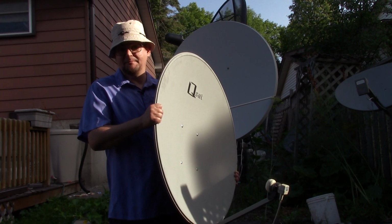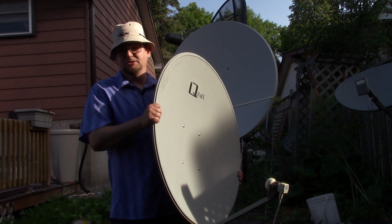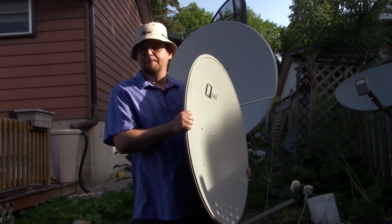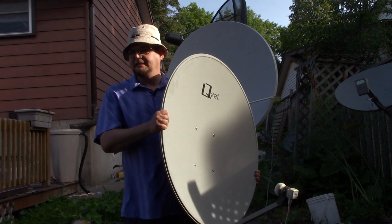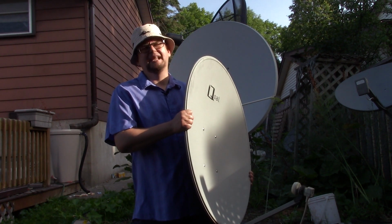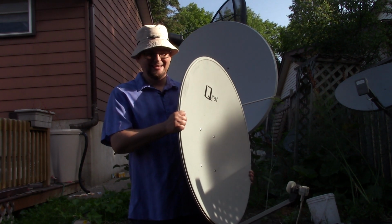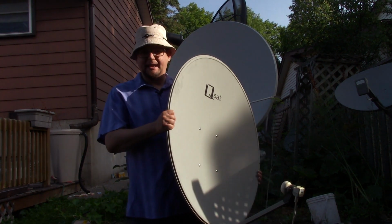If you want to just get into the hobby, I recommend that if you want to try it out, just buy a cheapie. Just make sure it's a DVB-S2 and it's able to get MPEG, at least MPEG-4. But nowadays you really want to keep an eye out for the ones like the Amiko, the Gamma and the Edision that can do the ultra high definition HEVC compression. So you want to keep an eye out for that kind of thing as well.